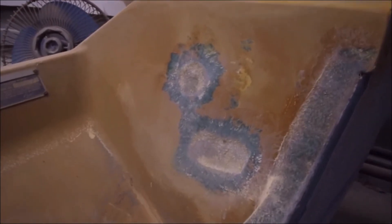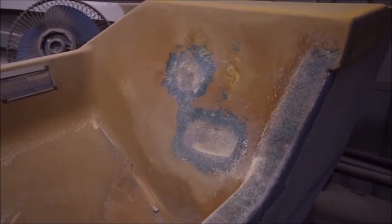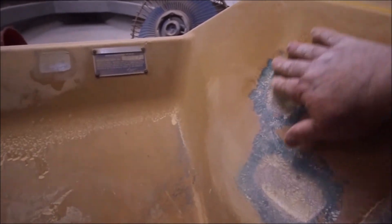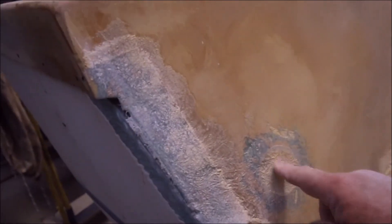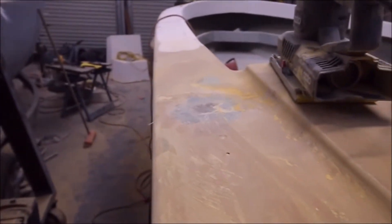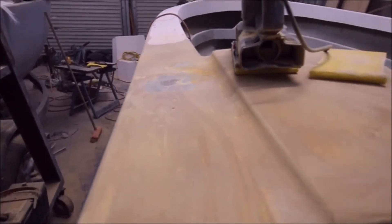The other thing we've done now is I've sanded back all of these rod holders and all the holes that we've had in it. We're actually back to almost flush there now, so that's good and strong all the way through — same strength as the rest of the boat. See where there was a rod holder over here — just the little fingerprints that are still left in that, and obviously the chop strand mat that you can see there. I can fill that up and make it look like the rest of the boat. You'll never ever notice that there was even a rod holder or a cut out in it.